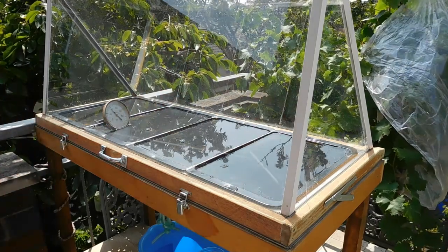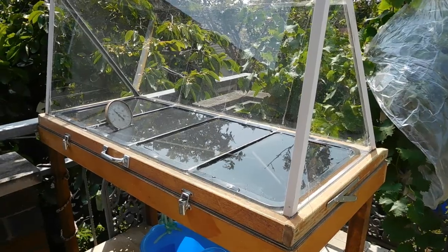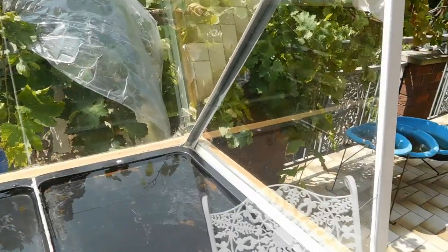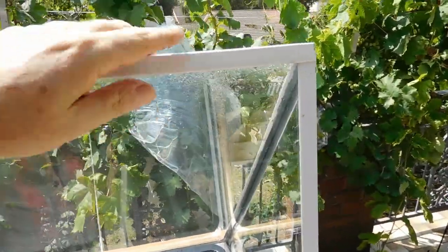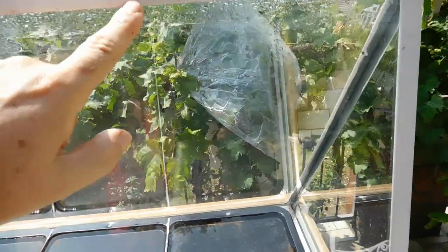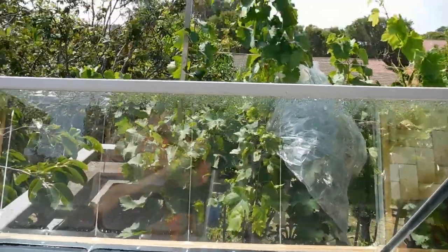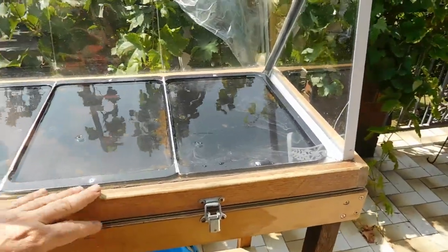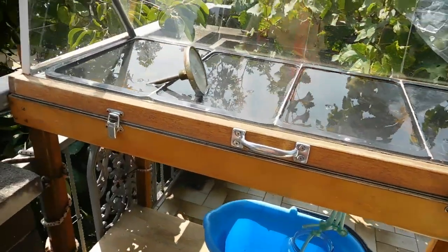I hope you enjoyed that. If you're wondering how I put the glass together, there's actually no sealant on the inside. The sealant is actually on the outside underneath these cap strips. I buttered the glass up together and then ran a bead of silastic on the outside of the glass, then put the cap strips on so that it's all stuck together from the outside — to keep the sealant out of the inside of the still. This is maple that I had lying around, coated with some marine epoxy, and just bits of ply that I had lying around to make the frame.